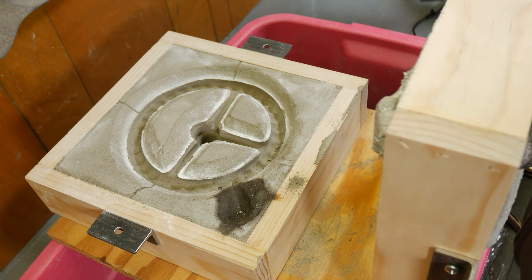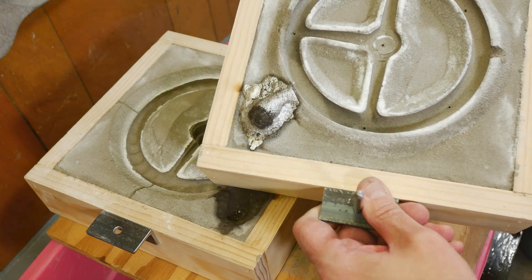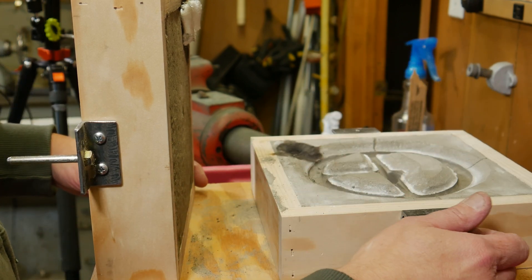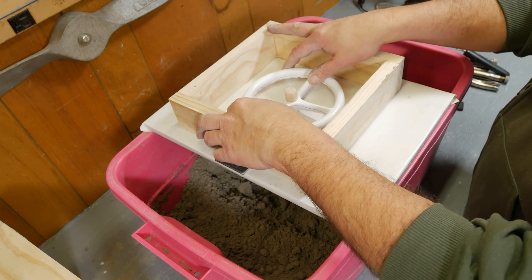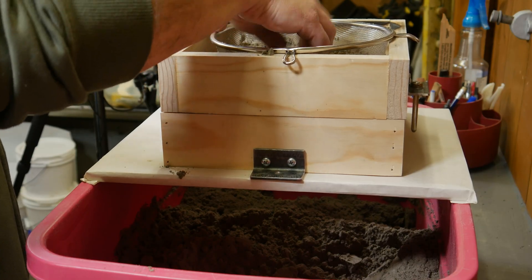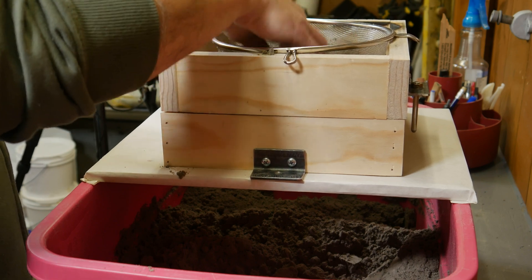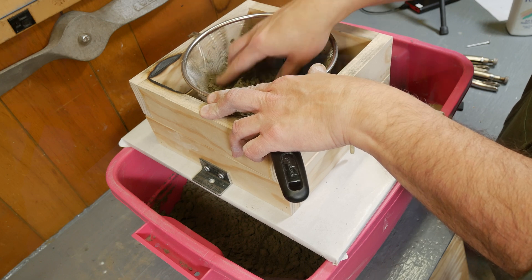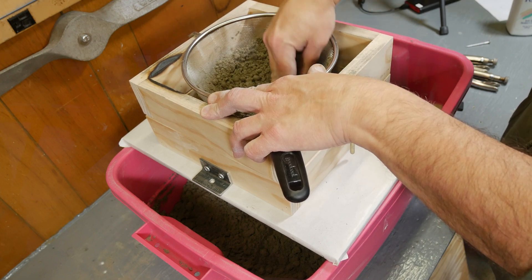The flask really needs to be a little bigger to give us more room for gates and runners. We're going to take what we learned from the last two attempts — keep what worked and change what didn't. I've determined the crucible is going to be barely big enough, and only if we pour straight down the center right into the hub. We don't have any extra capacity for risers or gates, so that's the way we're going to have to do it.